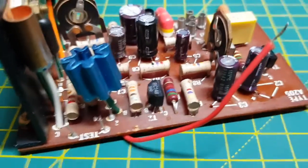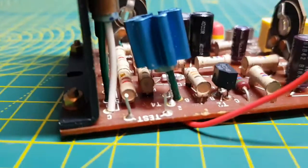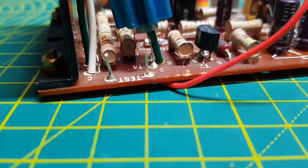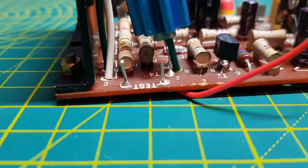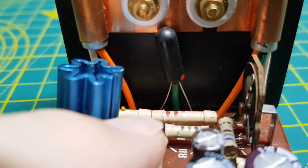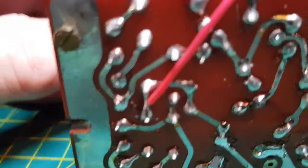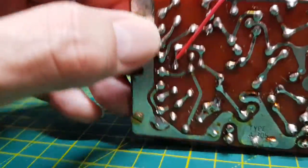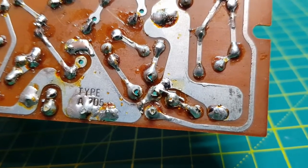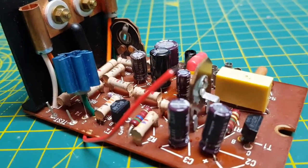It's not an issue really, it wouldn't have hurt the set at all. I suppose it just stops that little thump on startup — I do quite like that. So in preparation, I've cut the test loop. There's a link in there, so I've cut the link and just bent the legs up so I can connect onto it with my meter. That's for the quiescent current. For the midpoint voltage, you need to measure in between these two resistors at the back here — these two that are virtually touching. So the easiest thing to do is just stick a wire on the junction. I've just got a wire which I can hook up to the multimeter. And one other thing we need to do is just bridge the input to ground, so there's no signal coming in — it's a totally quiet set. Hence quiescent current — the current with no signal.